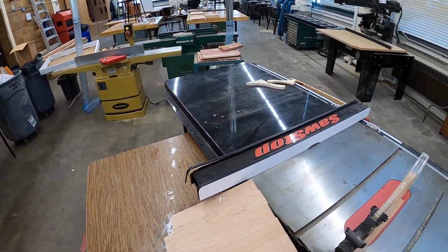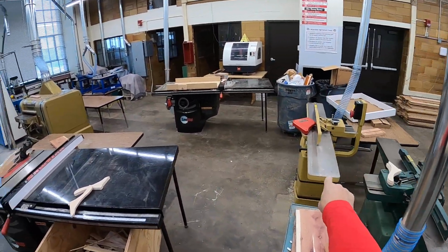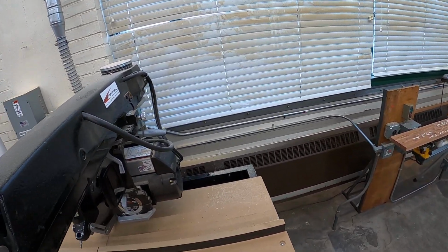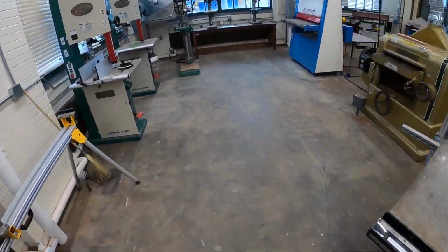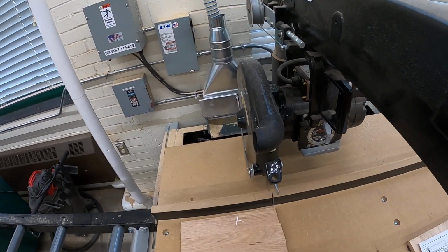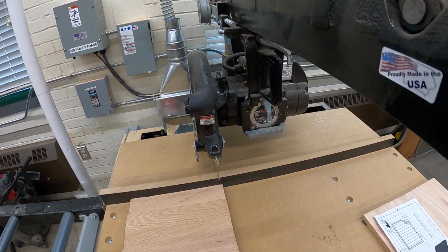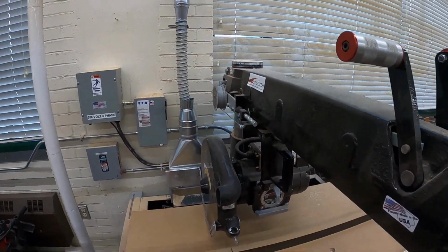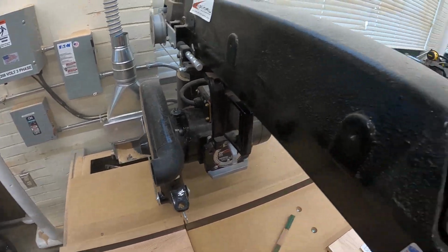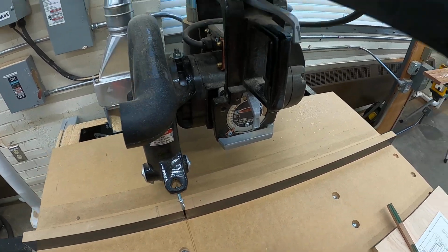Remember what step 3 and 4 are? Gotta cut them to length now. Okay, we went with the grain. This one's across the grain. So we just got our 16.5, so now we're looking for 12. I'm going to go grab my pencil. Had it in my ear, but it fell out on me because of the GoPro. Okay, this is the straightest edge, so I'm going to go with jointed edge against the fence. I'm going to take off the straightest edge. We've got an extra inch, so I can take off around a half inch. Okay, let's go ahead. That's step 3. Flip it over, measure 12. Step 4.